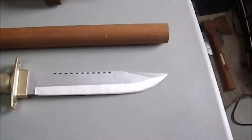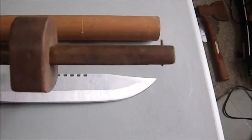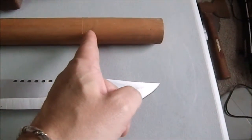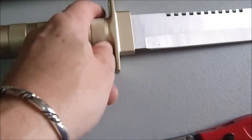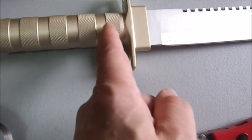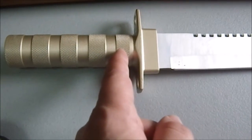What I'm going to do is carve out this a little bit. I used my antique marking gauge — which honestly needs to be sharpened — to leave a line here so I know where I want to go. There is actually a small point of metal here; it comes down to about here. So I want to make sure I set this on a shoulder. I've set the marking gauge to here, so that's where it's going to fit.